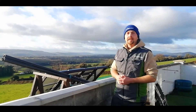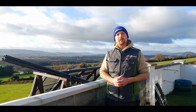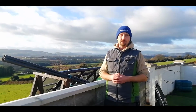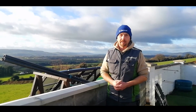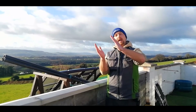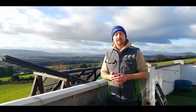There's one final thing we haven't mentioned yet — what operating conditions led to this failure. Simply enough, it was me. Every time the wind speed would exceed the turbine's rated output of 31 miles per hour, I would apply the brake. Recently we had storm conditions where the wind speed was up to 80 miles per hour, and with the brake applied the turbine was still rotating slowly — that generates energy, which generates heat that has nowhere to go, leading to the wiring failure. The WindSafe models that Istabreeze produce might be a good solution, where when the wind gets to a certain strength the whole propeller tilts back, reducing speed and reducing strain on the mast and wiring.